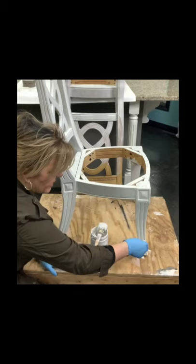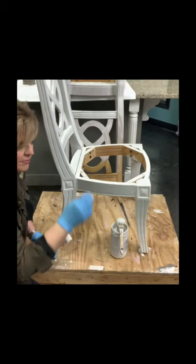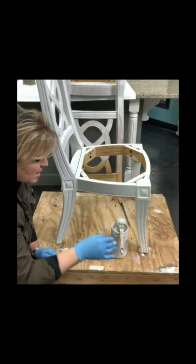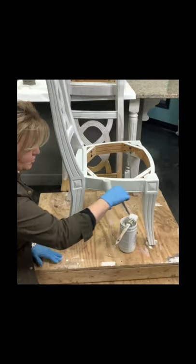Now, that applies to any paint — not just this paint — any paint you're using white over an old red piece or an antique. If you're trying to stop a dark color from coming through, it's kind of up to you. You can put on an additional coat of this product, use a white primer, or use our gray primer — it's all the same work, kind of a personal preference. This paint already contains its own bonding primer, so a separate primer isn't helping the paint stay on. The only thing it's doing is masking the old color from shining through.